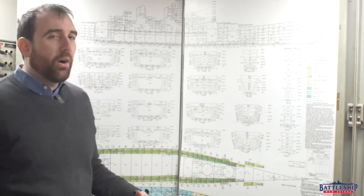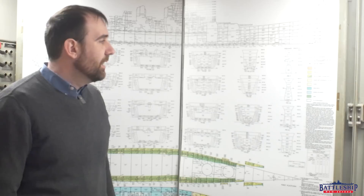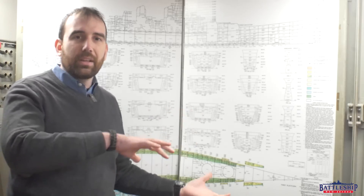Now that we've talked about the three types of tanks, there are other ways to divide them up. Any of the spaces shown in white are habitable spaces, or listed on the plate as all other spaces — those are the places where crew will be. Voids, represented in green on this chart, are normally left empty. They can be flooded to help correct a list, but they're normally left empty, and that is where a lot of the reserve of buoyancy in the Iowa-class comes from. These ships are tremendously heavy — we need spaces that are just filled with air to balloon us so we stay afloat, and those spaces also form our reserve of buoyancy so that if we start to flood on one side, we can flood over there and stay afloat better. It really helps with compartmentalization of the ship.